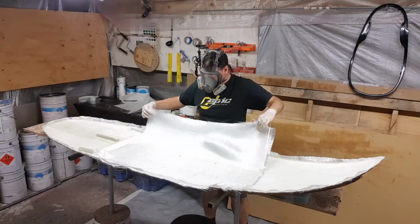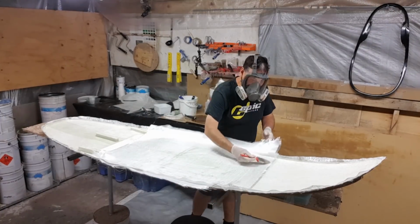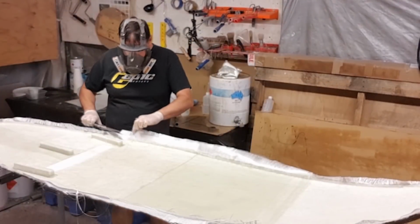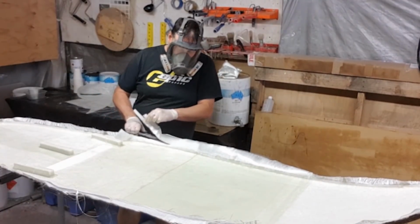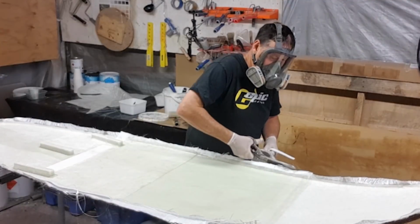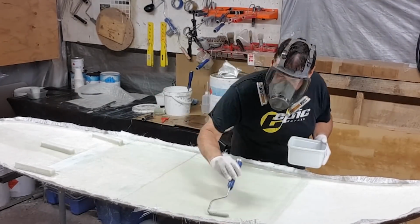And then layer 4, to form the sandwich with my core mat and to provide an extra layer of reinforcement on the actual hull, is a layer of 265 gram woven roving again. Once again, there's quite a bit of pleating and brushwork and cutting around the fin boxes and trimming required around the edge of the hull. So I'm forming quite a substantial laminate here, and that's 4 layers.